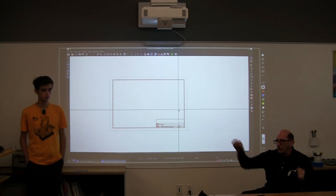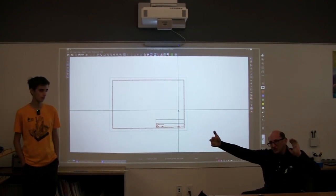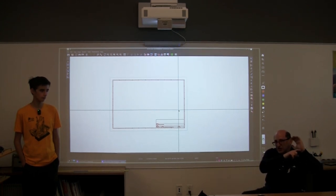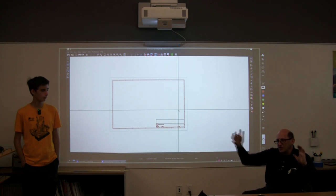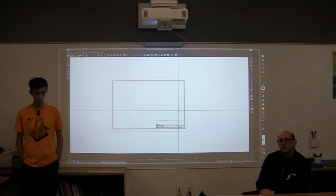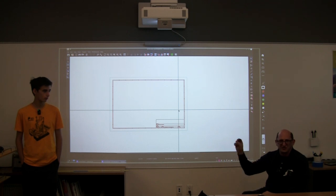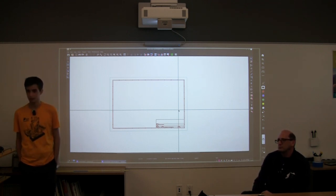So if you take a rope and you attach it to a wall and you flick it, the rope will hit the wall, and then you'll see this wave that hits the wall and kind of bounces back and reflects. But if you made that kind of just soft enough, it would end up absorbing that wave and keep it from reflecting. And that's what the purpose of the CAN terminators are anyway. It's a pretty simple looking circuit, but it does a really important task. So, does that make sense to everybody?